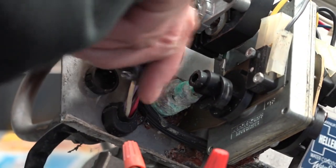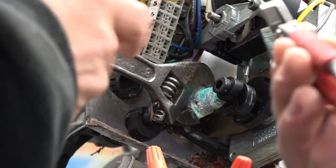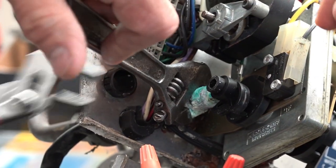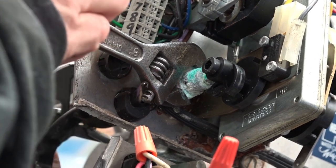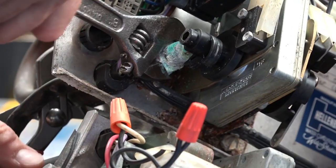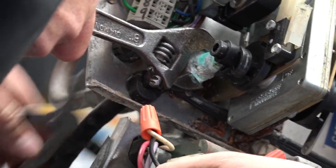Now the brine valve, as you can see, is extremely corroded. However, you're going to want to take that off before you try getting the back plate off, just for stability purposes. If you want to hold the back side with... just hold back there. That whole thing. Yep, so it goes right through the back. Oh, we may need to get a hammer. I'll get it down level where I can get it.